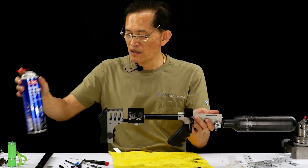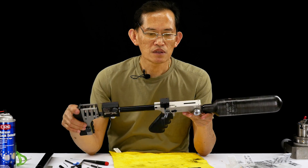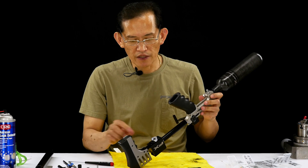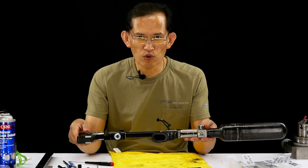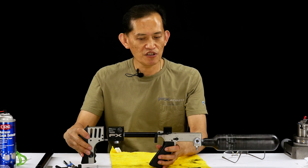Looks like she's holding the seal. Usually I let it sit 24 hours and check for a leak again. Before that, let it just sit overnight — mark the gauge with tape on the rig side and the supply side. If they don't move overnight and there's no leak, we'll reassemble the rest and continue with the reassembly.